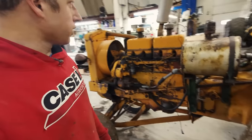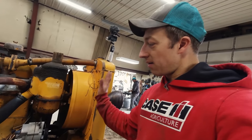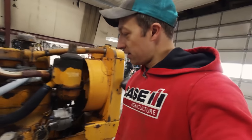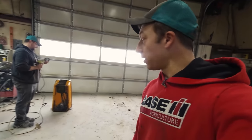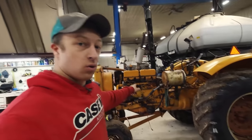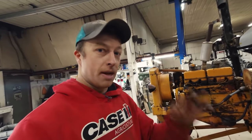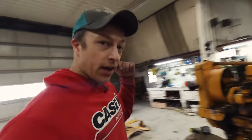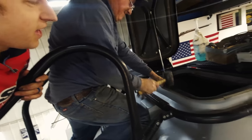I'm going to drop the oil on this thing, take the air cleaner - it's an oil bath type - and change the oil on that too. Clean that up, just going through odds and ends tidying it up. We'll probably wash the inside of the fuel tank out with a pressure washer, dry it, and brush it up real good. Might throw some primer on it while we've got it off. At some point when we do restore this old tractor, we'll have everything off, paint everything individually, and assemble it carefully so it looks mint - but we're not there yet.